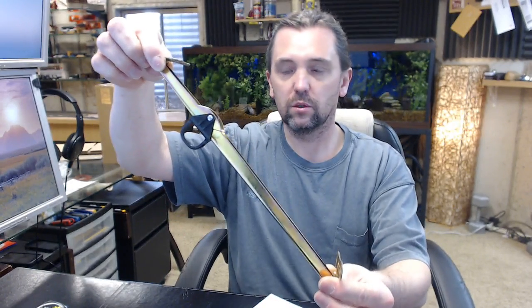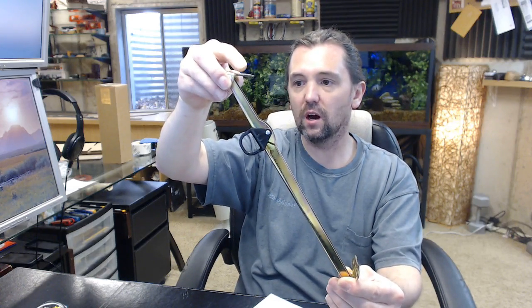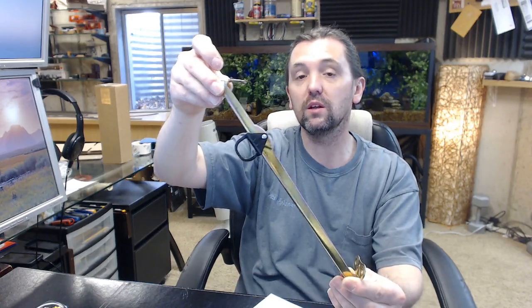Now, there is a link below this video to the installation instructions. Let's go over that now. So the orientation of the leaf is just like this, per the drawing as you're seeing it. This tab is vertical because it's being attached to the face of the table. This is horizontal because it's being attached to the leaf that's dropped.